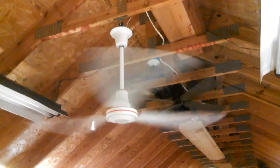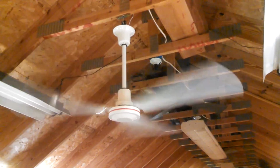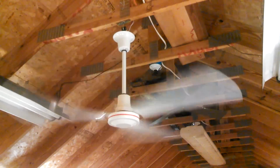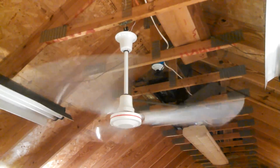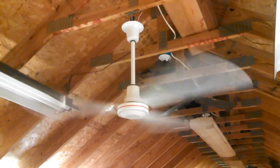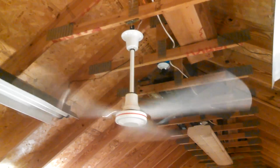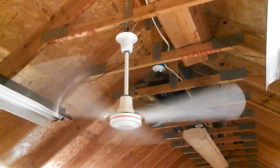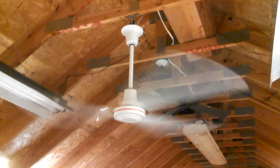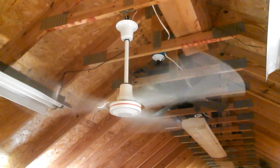Okay, 8 takes us to 0.72. Okay, well that's still under. 20 takes us to 0.75. You would think it's over the rated current, so you would think, but I'm going to hit high now. It goes up to 0.83, so it actually draws over the rated current. Let's see if it drops as it gets up to speed.